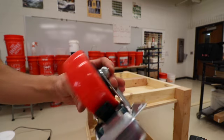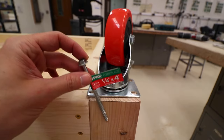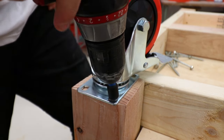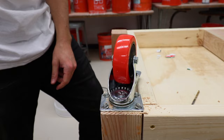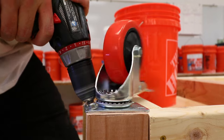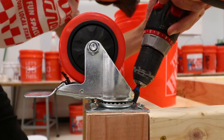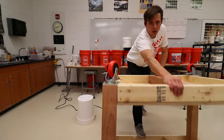The casters and the posts presented a bit of a challenge because the casters are for 4-inch posts, but 4x4 inch posts are really only 3.5 inches by 3.5 inches. To resolve this, I screwed the power lags in on an angle — first drilling pilot holes and then using a 3/8-inch drill bit to run the power lags into the posts. The angle drilling solved the problem of the caster being a bit wider than the bottom post. The only issue was if the power lags weren't screwed far enough in, the caster might hit them when twisting and swiveling. This only happened once; after re-drilling my pilot hole and screwing it in further at a different angle, the problem was solved.